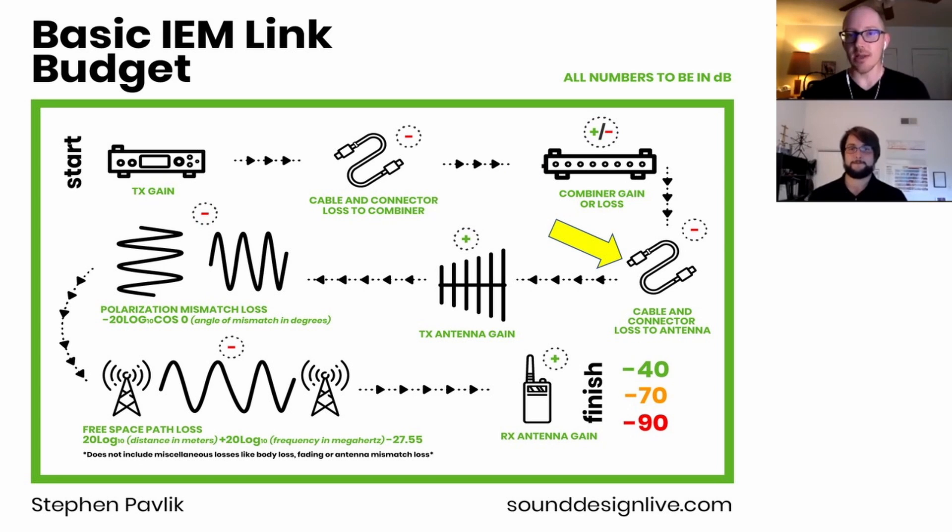There's another cable, so that's going to be a loss — there's the minus symbol. And then we have plus antenna gain. For our purposes, the antenna is going to almost always produce some amount of gain — we're pretty much not going to see negative gain; that's a very rare circumstance with a boutique specialty antenna we don't need to cover here.